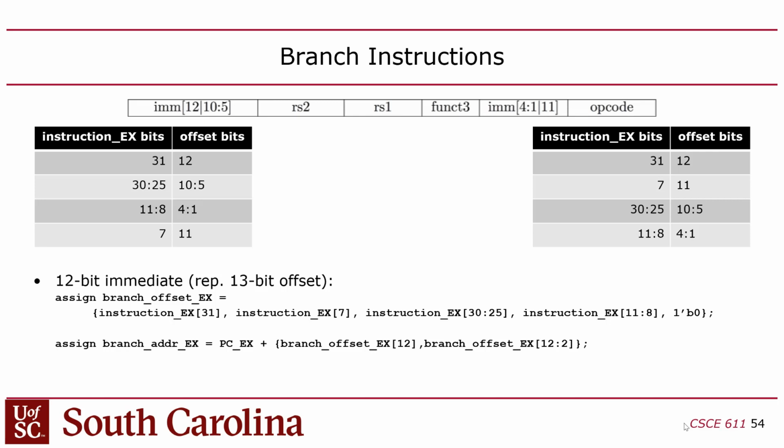Oh, but we don't, the offset is only... So the program counter is 12 bits, right? Because we have a 4,096 entry memory, but it's a word address memory. So we have a 4,000 instruction capacity. And so it's a 12-bit address to our instruction RAM. And then I basically adjust this to be 12 bits, and then I add, right?